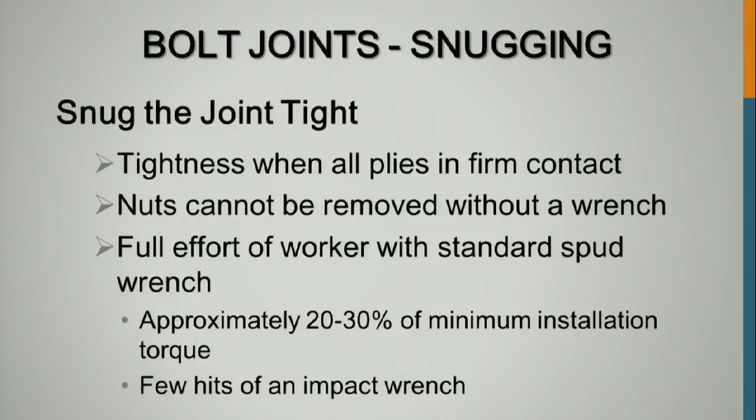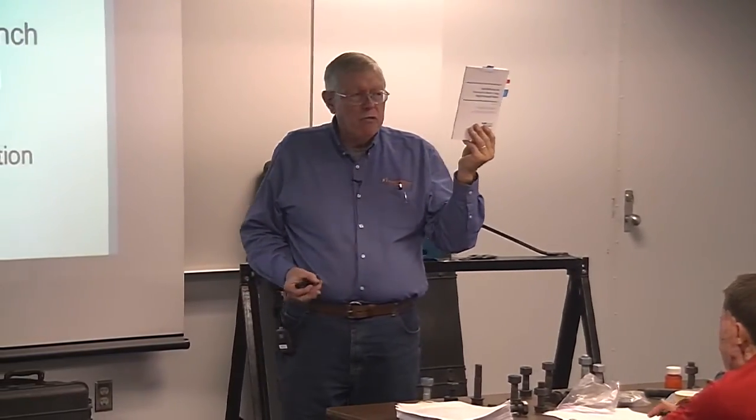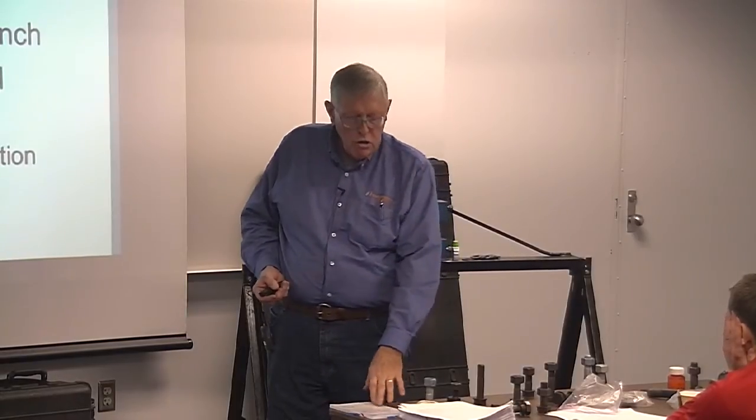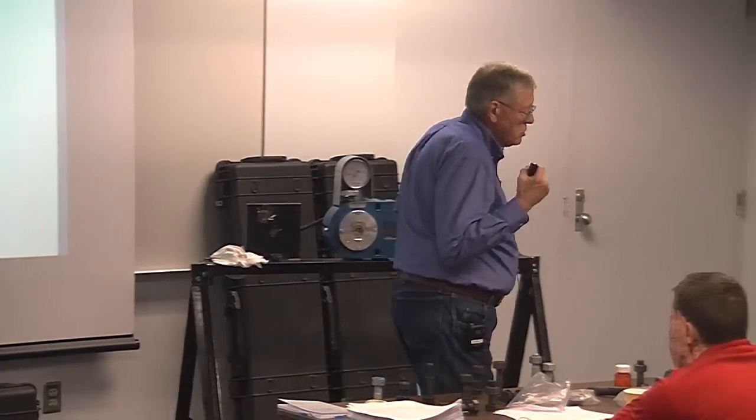Last June, at the Research Council meeting, we got a real issue, and we got a new spec that came out. This just came out in December. Brand new spec. It's going to be in the new AISC steel manual that comes out early this year. We put the rest of it back into the spec because we weren't getting enough snug tight. The snug tight condition wasn't high enough to make it work for turn of the nut method. So it's now including all of this. This is all back in the specification. We screwed up the spec in 2004 and we fixed it in 2009, and we fixed it this past fall in 2014 before we published the new book.